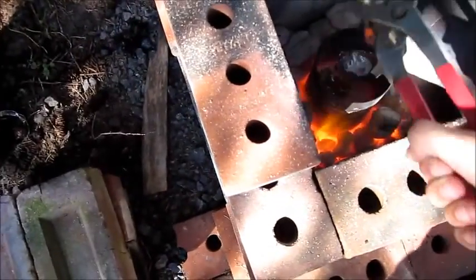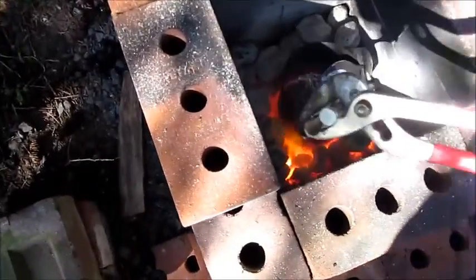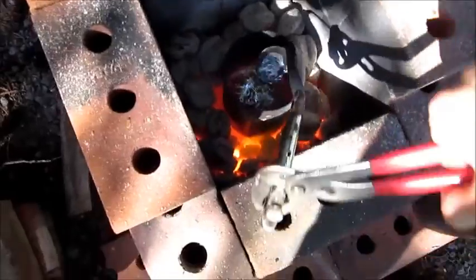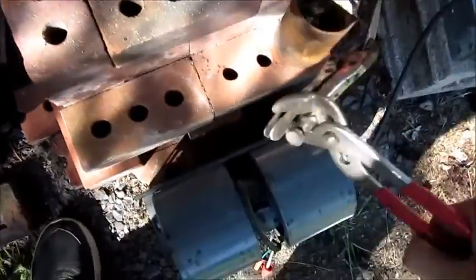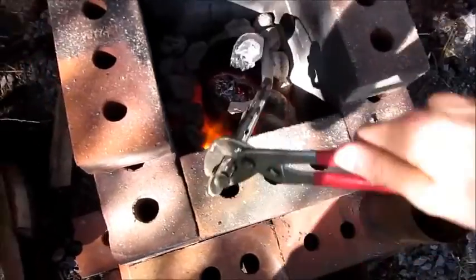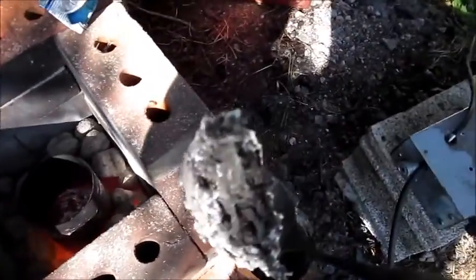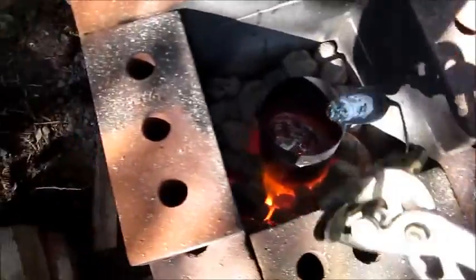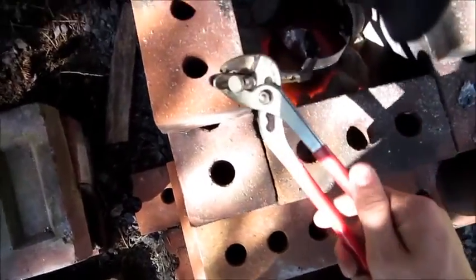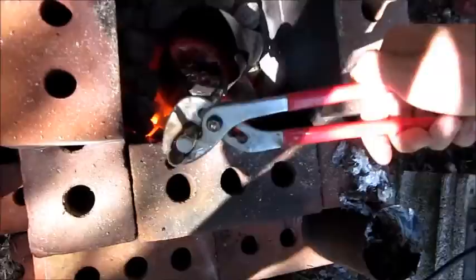Okay, so we're getting ready to pour. As you can see there's quite a bit of aluminum in there, and a lot of slag as well. So I have the good old sketchy tool here to try to scoop off some of the junk. I do recommend wearing a safety mask — a gas mask — because the fumes from aluminum aren't very healthy. If you want to minimize junk like this, you can take all the soda cans and just sand them with sandpaper before you put them in, which takes off all the labels, but it's pretty time consuming so I just put them right in.